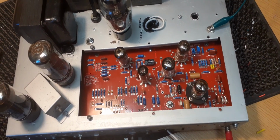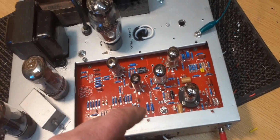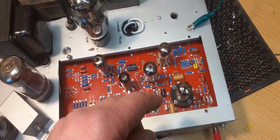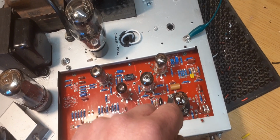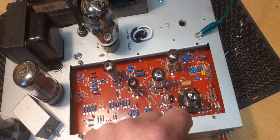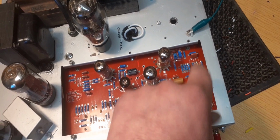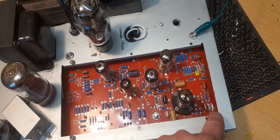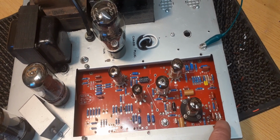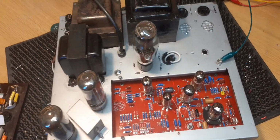This one is the ceramic conversion the customer wanted, but he also wanted the option to go back to Cobra if he wanted. So yeah, there are a couple of minor alterations to the amplifier that would need to be done to put it back to Cobra. Basically those two resistors there, I got the yellow ends on, reconnected, and then the input back in here from the Cobra cartridge. If you wanted to ever go back to it, God only knows why you would, but anyway, that's been done as the customer requested.